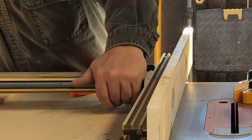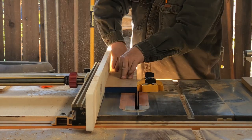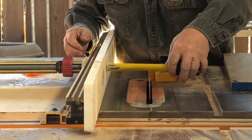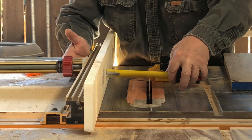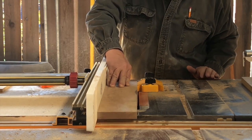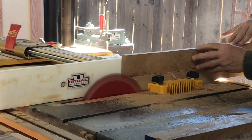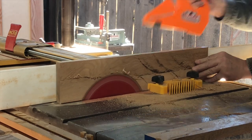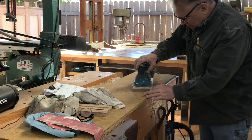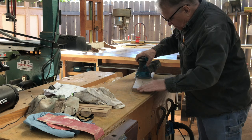Right now the sizes don't have to be super accurate. We're just getting in the neighborhood of the dimensions that we will need and we will fit everything as we build it. My real priority now is to just make certain that each board is square and true, so as I fit it and cut it during the build, I don't have to worry about things being out of square. And it always pays to sand your components as you go along, especially in areas where it'll be hard to reach into the corners and joints.